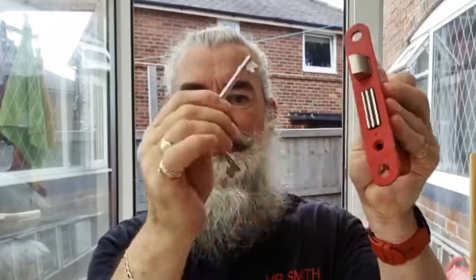It's on key set, so that proves that one works. And then the keys that I've just used on the other lock are different. So they're different, and they're not going to work on that. So I'm going to change the lever packs so this one matches the one that I've just shown you. Bear with me, I'll re-angle the camera so you can see what I'm doing.